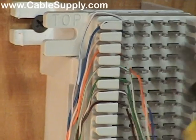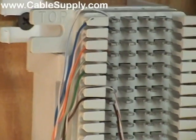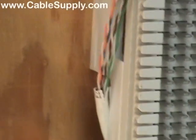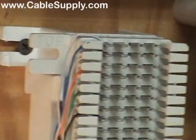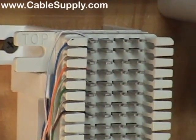The cutting end of the blade is facing down — you always go over top and then down. Notice how nice and tight that is along this side. We don't have a lot of loose cables sticking out. You want it tight — you don't have to be gorilla tight, but you want it snug to the side. That makes for a neat install.